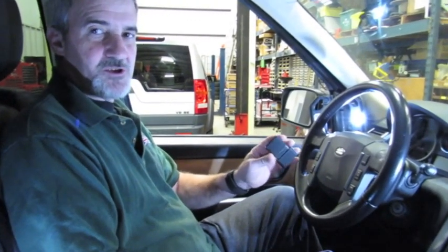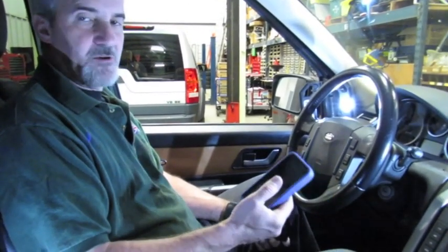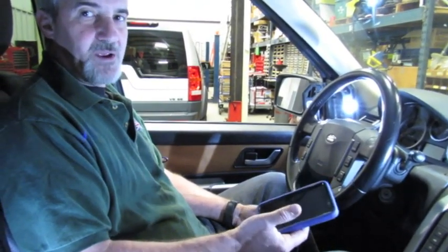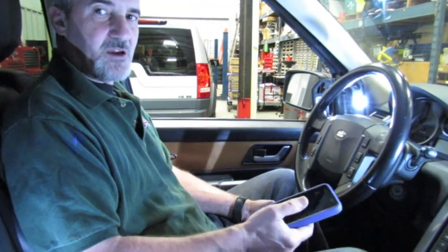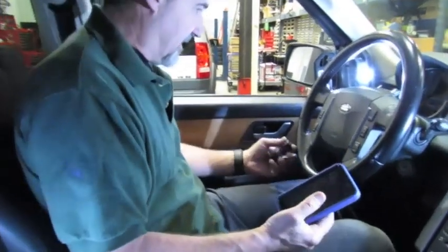So the next step is we're going to plug in our dongle. We're going to make sure we see the blue LED that's powered up. We'll turn on our smartphone. Now, just as a note: on Android systems you're going to have a single icon — you click on that. If you're using an iPhone or iPad, you're going to have two icons, one with a blue dot. You do not use that icon. You use the i-Land icon that does not have the blue dot. Otherwise, if you click on the second one, you're going to get no connection.